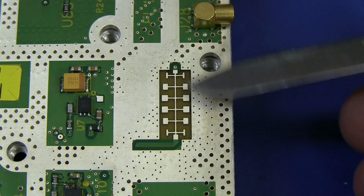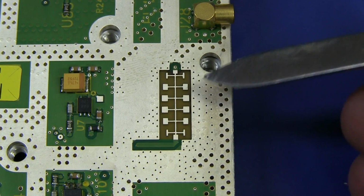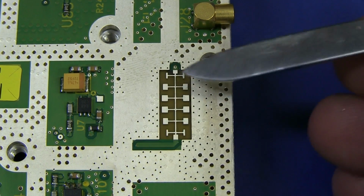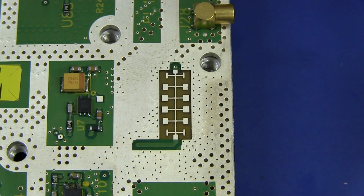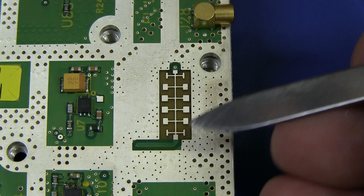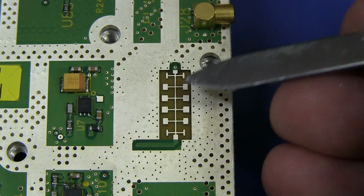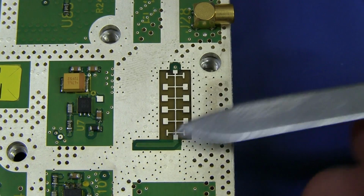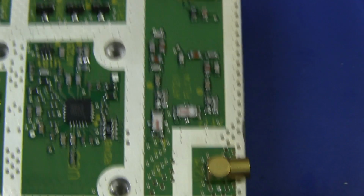Lots of technology, of course, goes into actually designing these things and ensuring that their performance is smack on target, because you can get better performance on the PCB than you do using discrete components. It's a very controlled impedance material they got in here. They'll know the exact dielectric constant and characteristics of it. They can program that into their RF filter layout programs, which then you can simulate and design all these things.